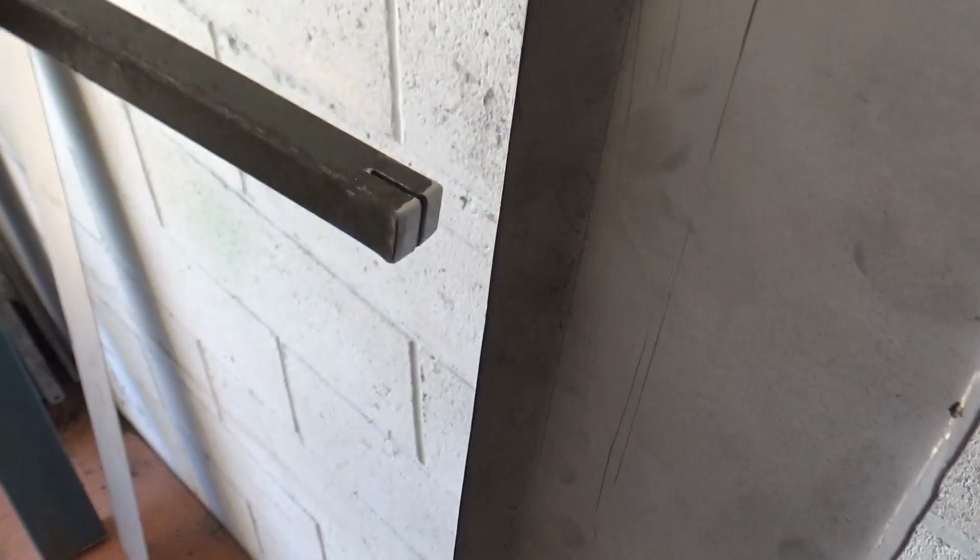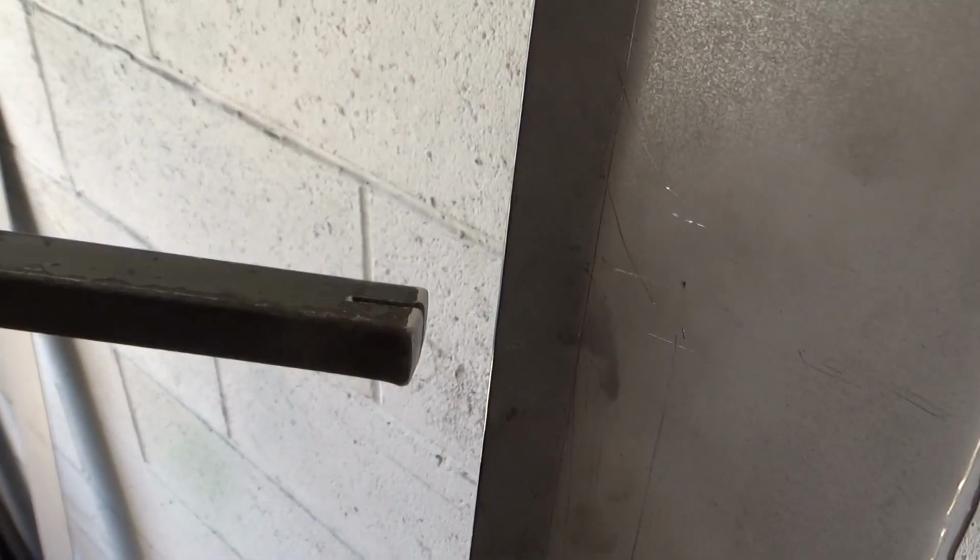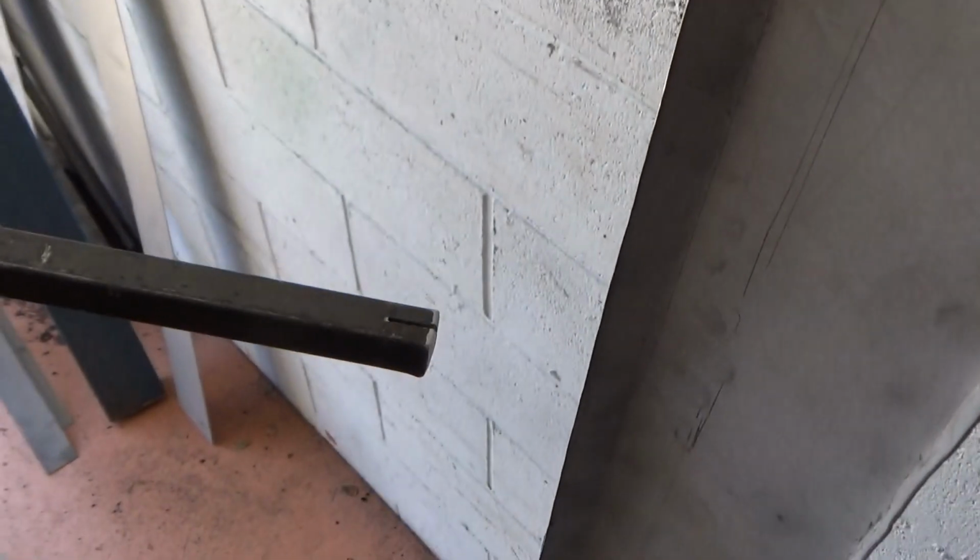So one goes in there, right, and you just put it in and then tip it and you break the edge. You just do a little bit at a time, like 5 degrees, 10 degrees. You work your way along and you come back and you do it again, and then you increase it, you go back, and you increase it and you go back, and you don't get any stretching, minimal stretching anyway. So that's the long one, and then this is the short one.